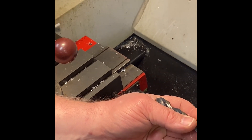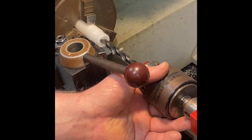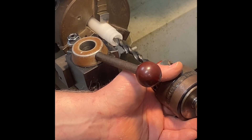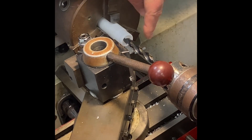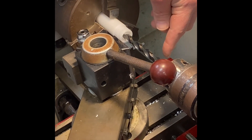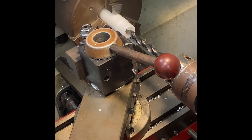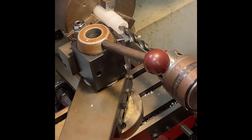I'm using a smaller drill bit — I'm not going to be cutting, I'm just using it as a parts catcher more or less. I don't want to go too far in because I don't want my parting tool to hit that drill bit. You can use a drill bit, a small diameter rod, or anything that will just help catch that piece and keep it from slinging at you when it parts off. I'm going to finish parting this off to finish the ring.